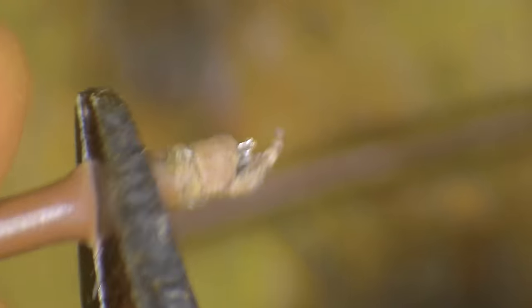Here we have two wires ready for joining — they've both got solder on them, so I don't really need any more solder, but I could grab some if needed. I apply heat to the area and then just melt those two together. There we go. Making sure it cools — don't pull them apart too early otherwise the solder won't have cooled. As you can see, it's cooled and solidified and we've now got a nice neat and tidy join. That join is probably stronger than the wire itself — if you pulled them apart it would probably break somewhere else before it broke at that join.